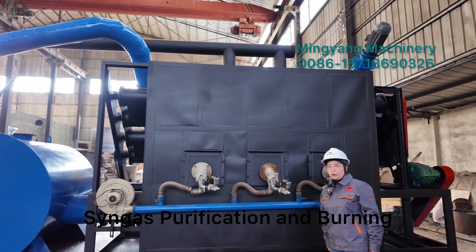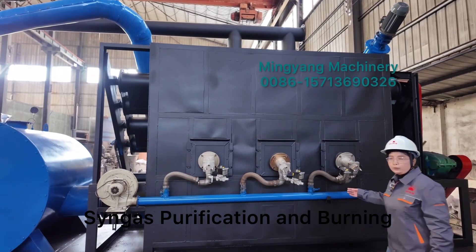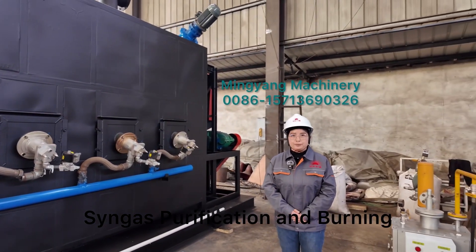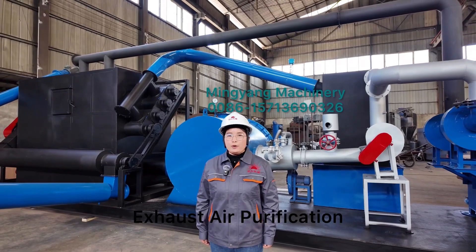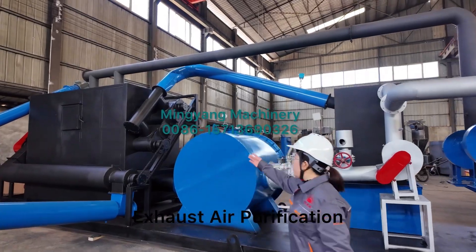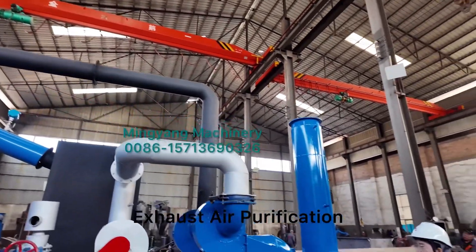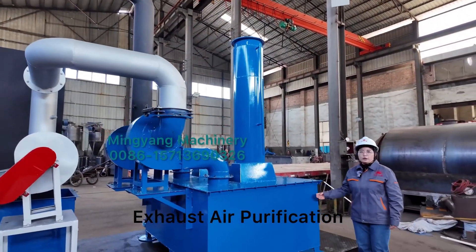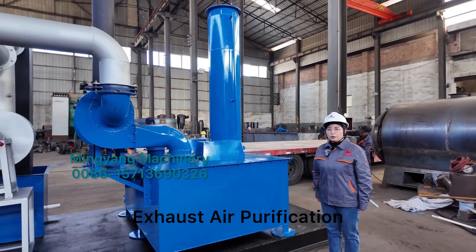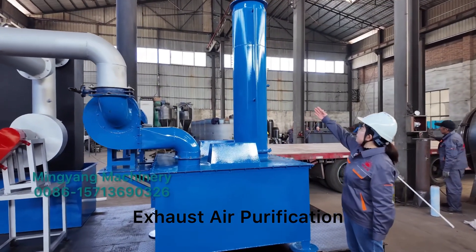When the complete cycle is achieved, we can close the pre-heating system, so we can save a lot of energy during production. During the pyrolysis reaction, a small amount of hot air will come out through this pipeline to our dust removal scrubber. From this scrubber, we can reduce the dust in the hot air and also decrease the hot air temperature before emission from the chimney.